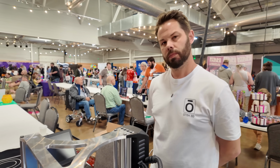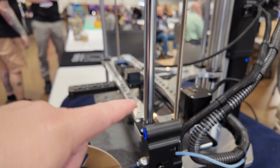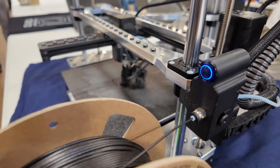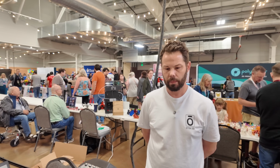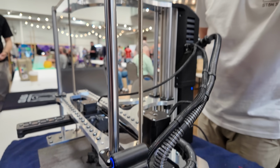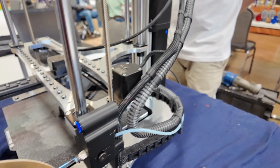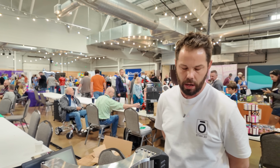50 dBs. So for the electronics here, this is all very clean. So I guess we'll start here. The filament comes in here. Do we have anything special going on here? I do see a button. A filament sensor. It's run out and movement. Okay. Basically a gutted SFS, smart filament sensor. Excellent. And then an e-stop kill switch. So that's an e-stop right there? Yeah, that's a kill switch. E-stop. And you can program it to do whatever you want. Like long press is load filament, double press is unload, but right now it's set up as e-stop.